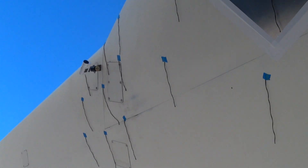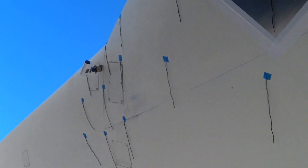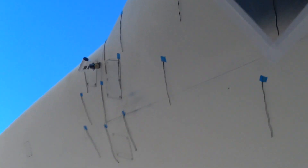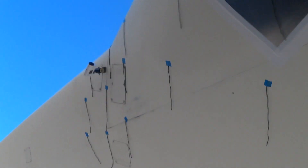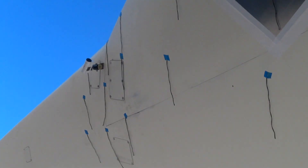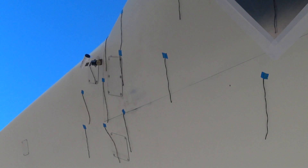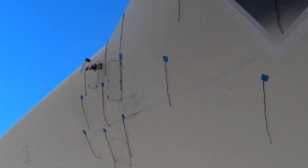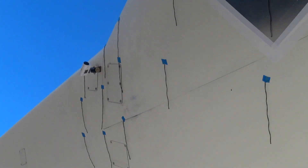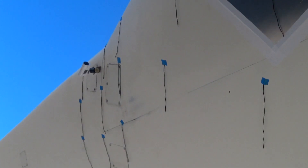I wanted to see what's going on at the wing. I was worried about spanwise flow, but looking at the telltales, they're actually pulling inboard rather than outboard — right at the transition line — which means we're not getting spanwise flow outboard, and that's a good thing. I'll have to see how that plays out once the aircraft is airborne or even just in ground effect. I wanted to get this camera angle sorted out to see how well I can monitor what's going on there.